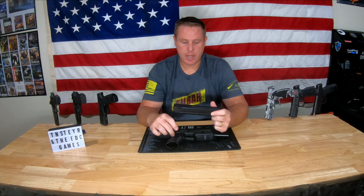On the rear of the gun, it actually has a charging system very similar to an AR. When you get into it, you just reach back, pull, and release it. It does have a bolt hold open on the left-hand side here. It will lock on the last round. Run that forward. The charge handle is non-reciprocating, so once you've charged it and start to run an operation, you don't have to worry about it moving, it locks in.